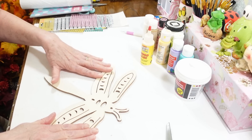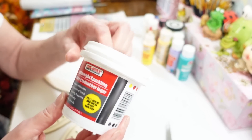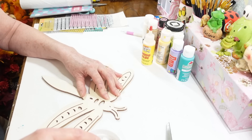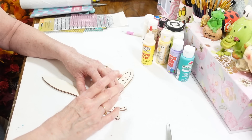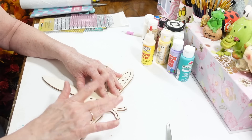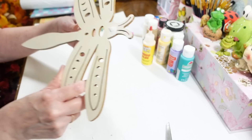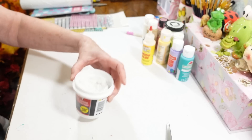I also want to cover up the hole where the string was, since we're not going to use that hole to hang it. I'm going to take some lightweight spackle — you can get that in the hardware department at Dollar Tree too — and fill that hole in. You want to overfill it a little because it'll sink in. After it dries, just take a little piece of sandpaper and sand it right off, and your hole is gone. I already have one painted up, but that's how I glued it together and got rid of the hole.